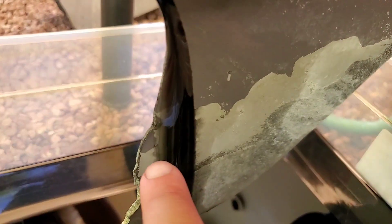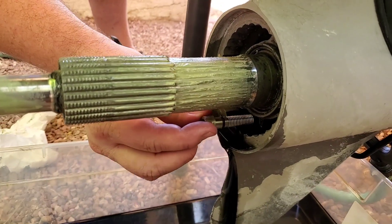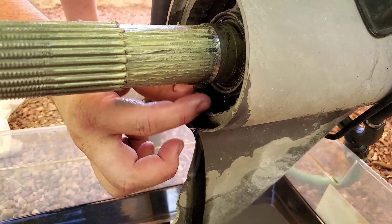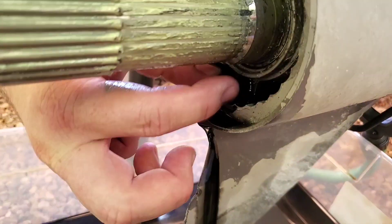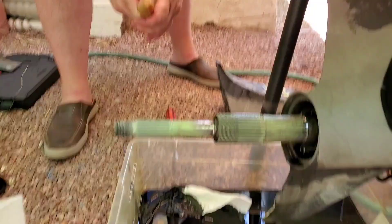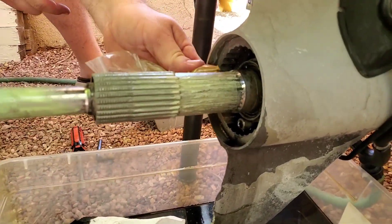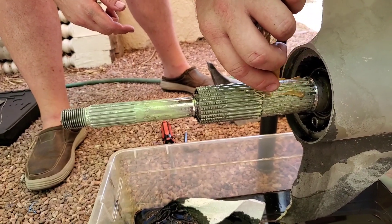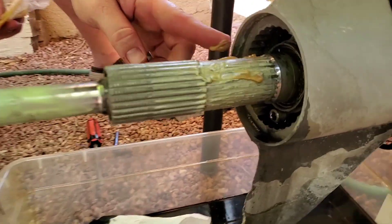She looks pretty darn good — you can see on the edges it's running a lot clearer now. We're going to cork her up and fill her up. We're going to torque her down pretty light — a lot of this is aluminum and you don't want to strip your bolts. For the 8 millimeter Allen key, I'd do 12 pounds of torque. Extra due diligence — we're going to put a little bit of grease on there. We'll be putting the props back on; they go on very straightforward, slide on like butter. Tightened up to about 12 pounds of torque. Looking at the gear lube, I'm not really seeing any metallic, but it's definitely oxidized — that's what happens when you get water in it, especially saltwater.